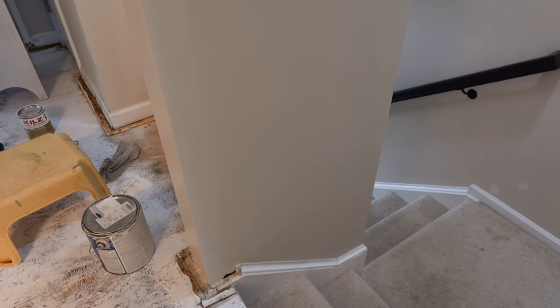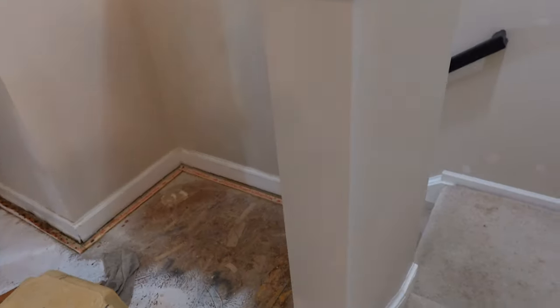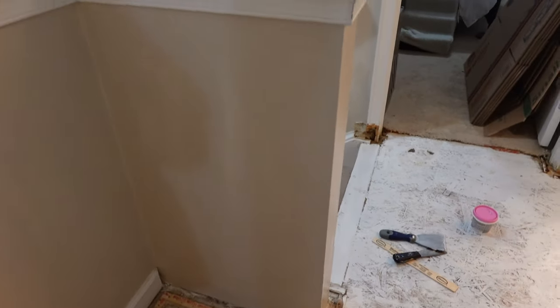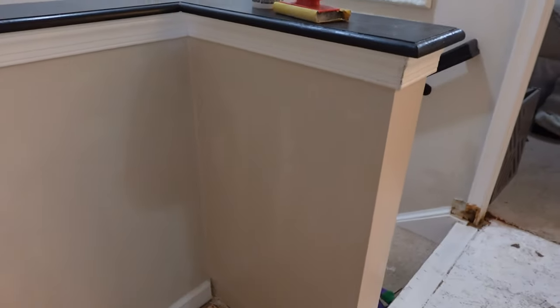All right, so I've completed this wall with paint. I've put two coats of paint on this wall. I've put two coats on this one, it's still drying, and one coat on this one. I cut in around here and started up this wall, and I said you know what, I'm going to get a roller, because I'm having to go over it twice with a brush, and when you use a roller it's like two coats in one. This looks like part of it's drying — that's when I'll be able to tell where I need to hit it again. So I'm going to go get a roller and finish up this wall, this wall, this, and then this wall.